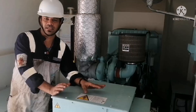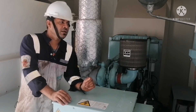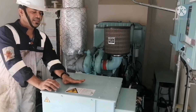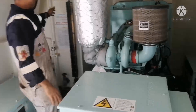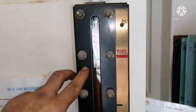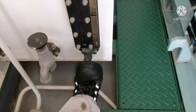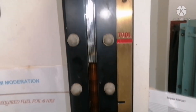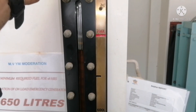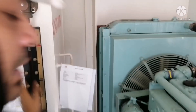We came to try out the emergency generator. We usually do this tryout on Saturdays. Before trying out, the first thing to check is the diesel oil tank level — this tank should always be full. To check, press both the top and bottom knobs and you can find the exact level. The oil level is okay.